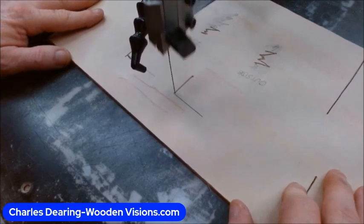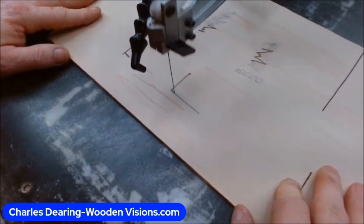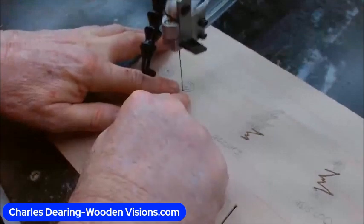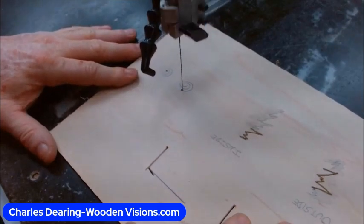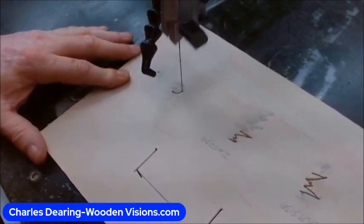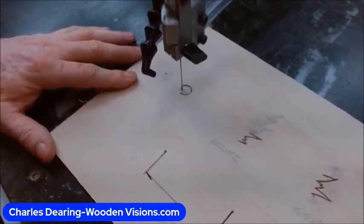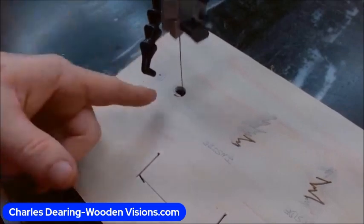Right about here I'm slowing my feed down and slowly turning it. I'm going to show you the difference between starting on the outside of a spiral versus the inside. Remember each time you can have your fingers right there to stabilize everything, even if you want to be holding the actual drawing of the spiral — not the spiral blade. I'm not really concentrating on staying on the line; I'm more so doing the shape of a spiral just to show you that from the outside it's going to be weaker, and the closer I get to the middle of that spiral — see what happened, it broke.